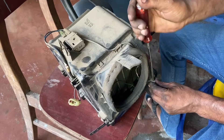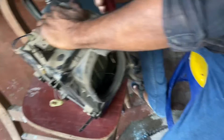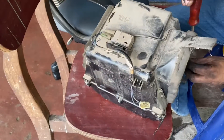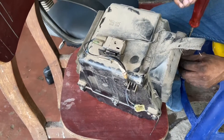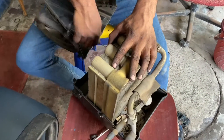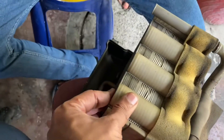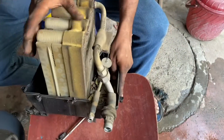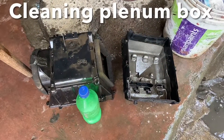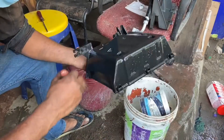The evaporator coil is located inside this plenum box, so we will dismantle the box and remove the coil — and that's our replacement evaporator unit right there. The plenum box has been finally dismantled and here is our stock evaporator coil. You can also see all the leaves, feathers, and such that have made their way inside. We have now soaked the innards of the box with soapy water for a proper cleaning before installing the new coil.